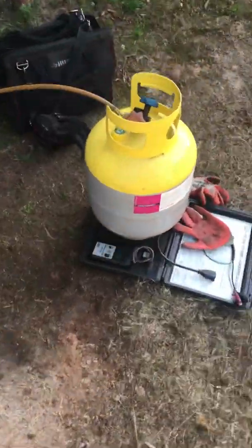There was a filter dryer down in the heat pump itself. I had about two degrees differential on one side of the filter dryer versus the other, so I went ahead and pulled it out from inside the unit and put it out here where it's way easier to get to. I ran straight pipe off of the TXV on the inside.